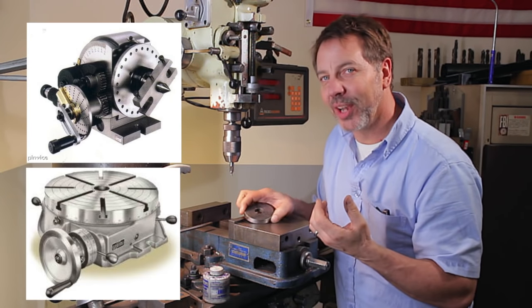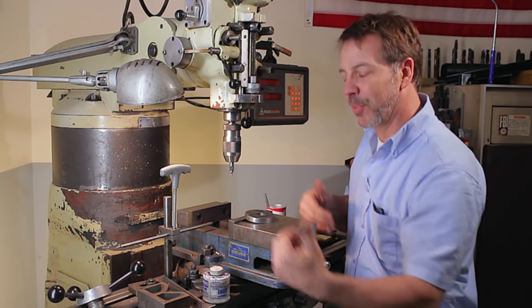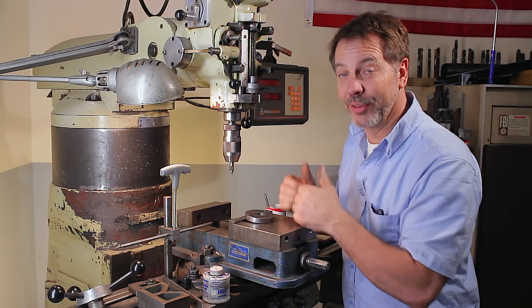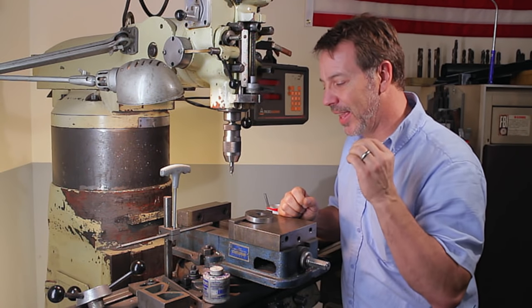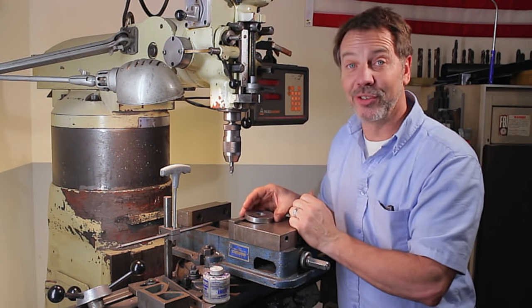That's really a good question, because to set up your rotary table you have to take your vice off, bring up your rotary table, get it lined up before you can drill any holes, and then take it off and put your vice back up. So you're talking a good 30-45 minutes worth of labor. But is there a shortcut? That's what Jim wants to know, and the answer is yes.